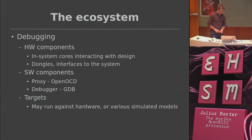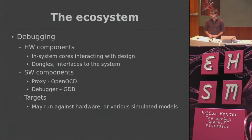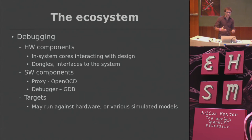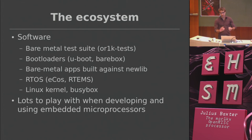Another big challenge: once you've got your microprocessor on an FPGA or simulation model, you've got to talk to it — get code into it, debug it, and run it. You'll need dongles or some way to go in over the FPGA's JTAG interface, which is tricky to get working. You can also attach a debug proxy to a simulated model and GDB into it and debug it, which is quite handy. And of course there's tons of software which runs on top of all this.